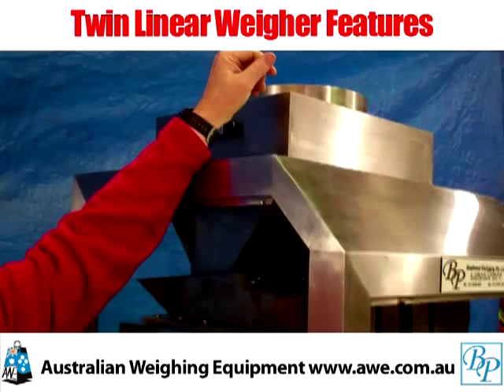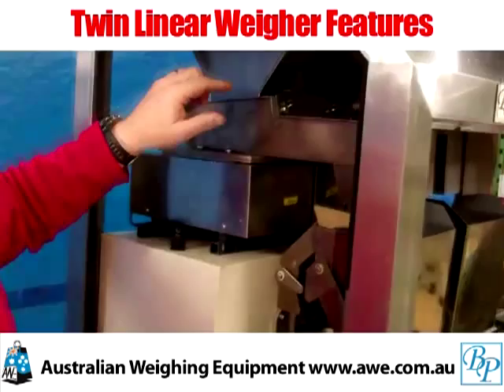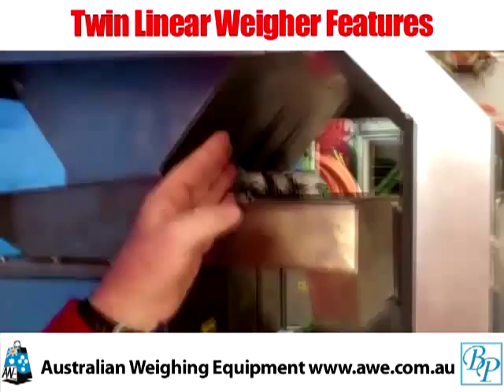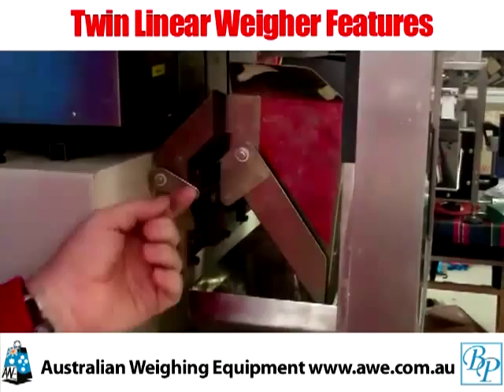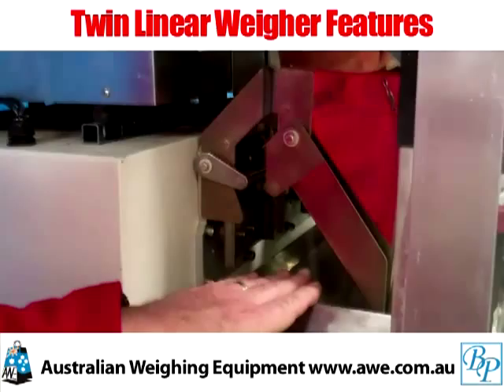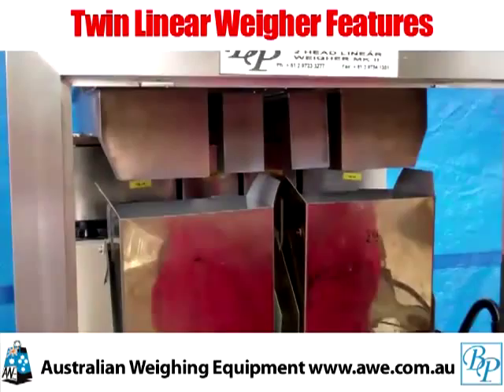The product flow inside is compartmentalised and it distributes into these four vibratory feeders. The vibratory feeders — I'll show you those shortly — feed into a weigh bucket. With this being an all-electric machine, it has a discharge mechanism dropping down into the chute and then into the bag. The machine runs automatically so as to have a batch ready for the operator to bag successfully.